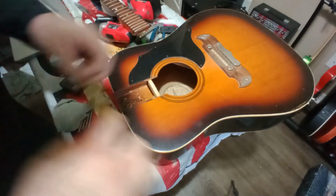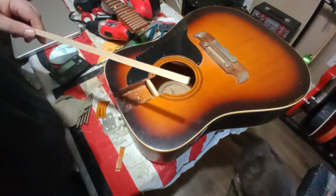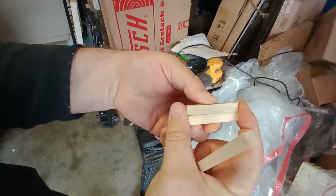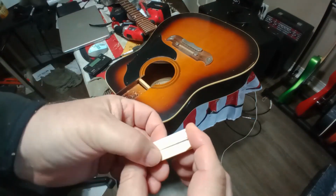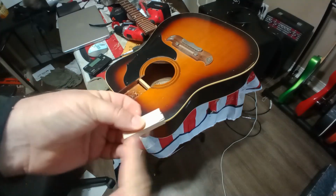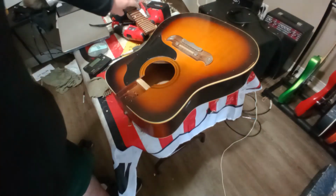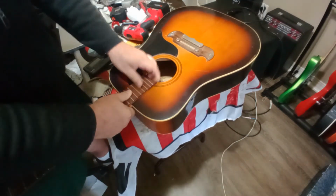Looks like a glove? Perfect. That's what you call skill. Now we were off exactly 3/8 of an inch, and that's what these measure, 3/8 of an inch. So I'm going to stack them, and I'm gonna have to sand one side down to not fit up there too tall. Right now it's okay. I can test it and measure and make sure we're gonna be within the marker there, because that's going to butt right up next to it.